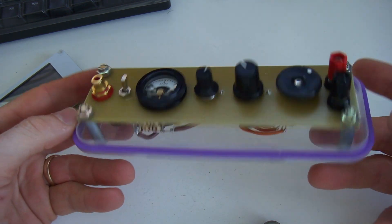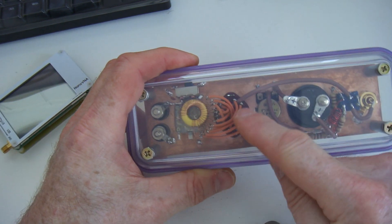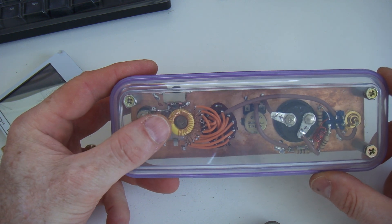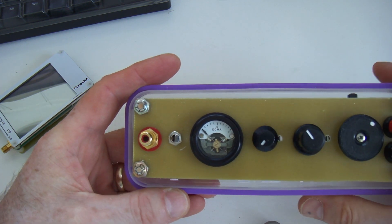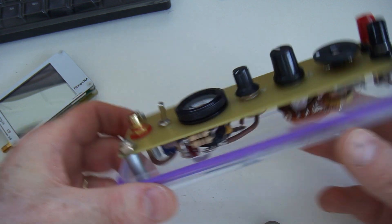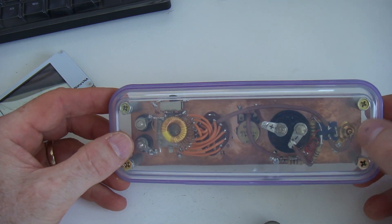All in all, it's actually working really well. There's no change at all to the schematic other than using a 12-turn or 12-position rotary switch for the taps on that T68-6. I'm now tapping from the third turn through to the 14th turn. The only other thing to note is that the potentiometer used to adjust the sensitivity on the meter is a 50k ohm pot, not a 10k — that was an error mentioned last time. Otherwise it's just been repackaged into this container, using the ground plane as a common ground attached to the counterpoise all the way through to the input RF.